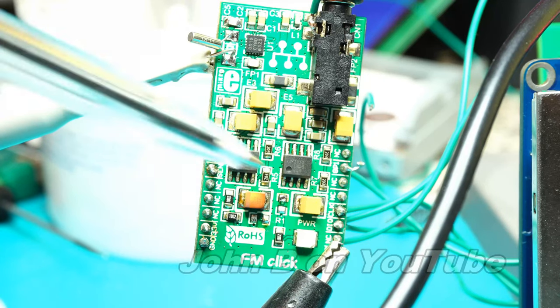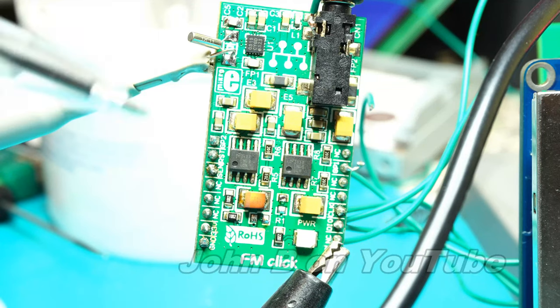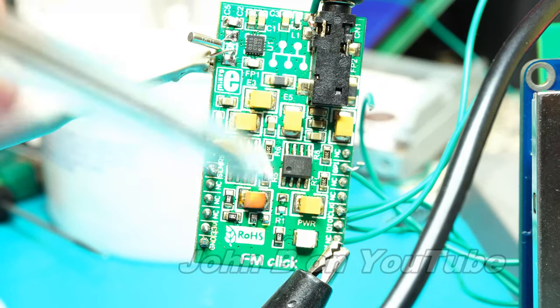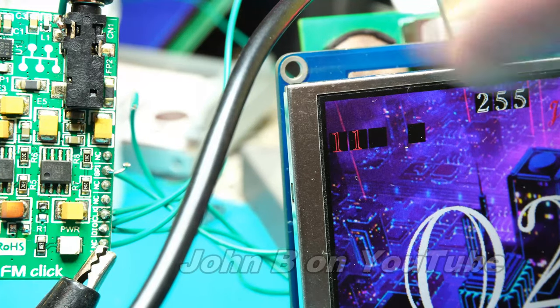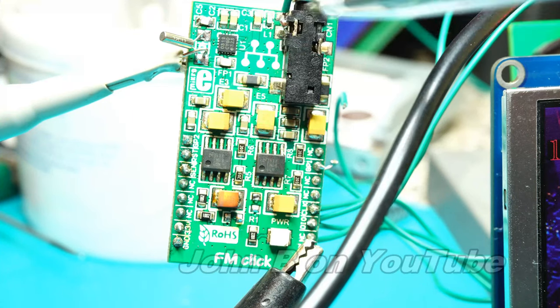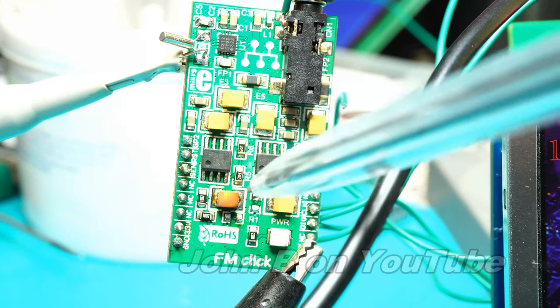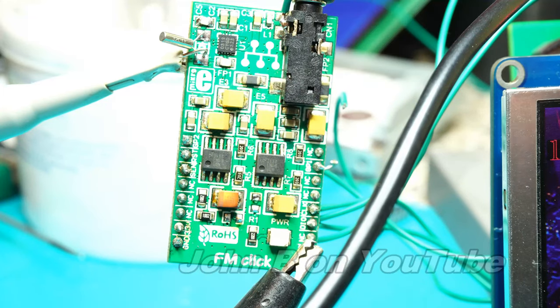But then last night I thought, well, this board had two pull-up resistors for the I2C. Hopefully you're familiar with pull-up resistors. So I decided to take the pull-up resistors off. My clock board already has pull-up resistors on, 4K7, so plus those 4K7s, I thought maybe this hasn't got enough internal drive current to pull the line down. So I took off these two 4K7s. Just for a brief few minutes, I got a radio signal. When I altered the code, tried to get a different signal, that was it, I got nothing.